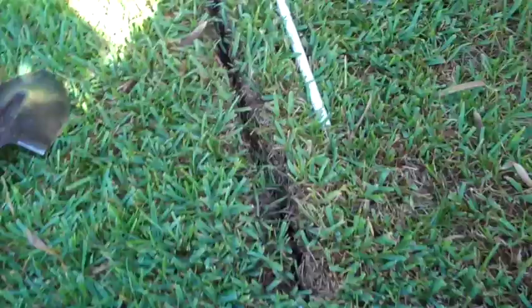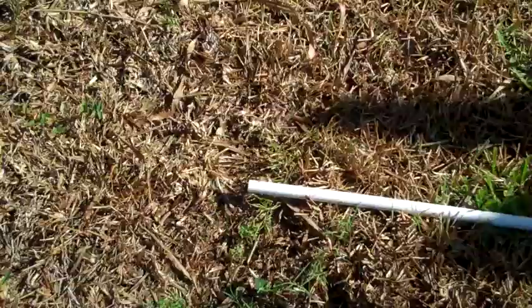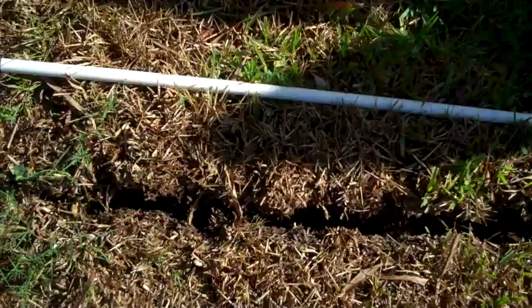You've got this piece all connected, you've got your pipe running over there, and you've got your next piece of pipe over here. The next thing you want to do is couple these two together using the method I showed you earlier. After that's attached, put it in the ground at the proper angle — this is where you're going to put your upright for your sprinkler head. Go ahead and glue that on, attach your sprinkler head, and make sure you get all of this down in the ground deep enough.